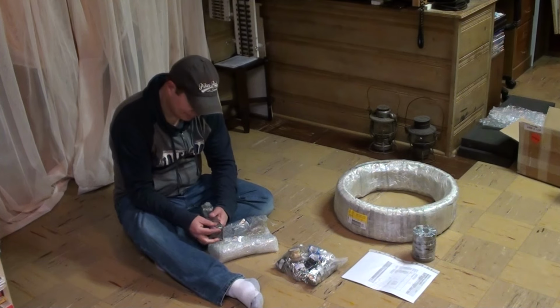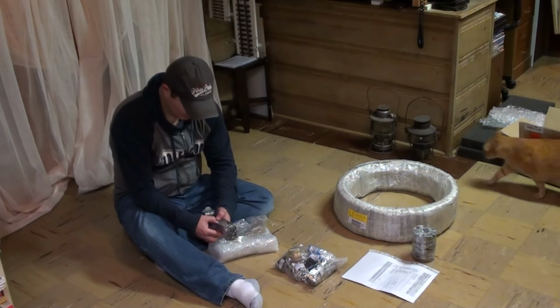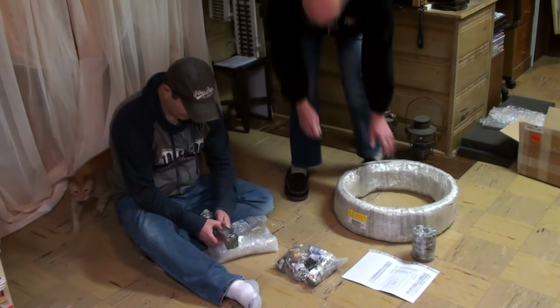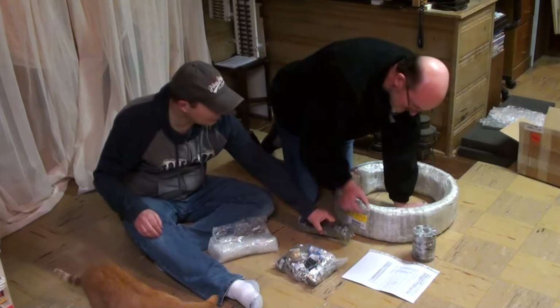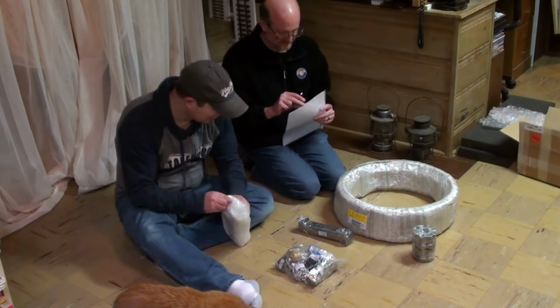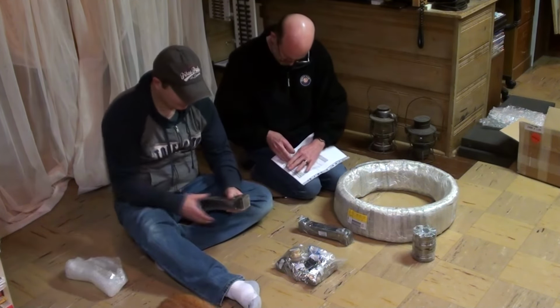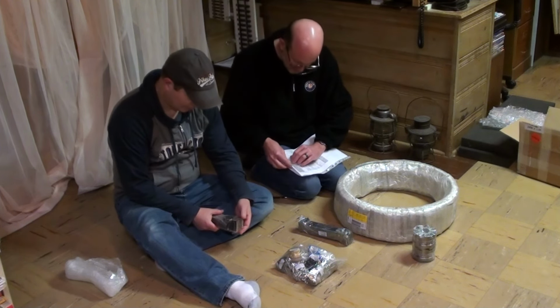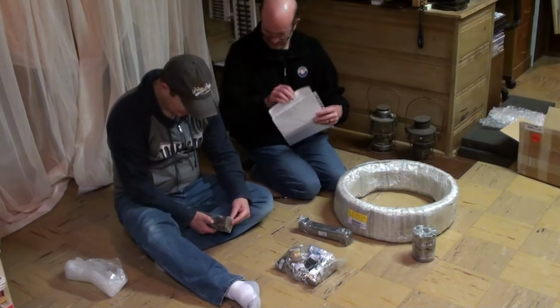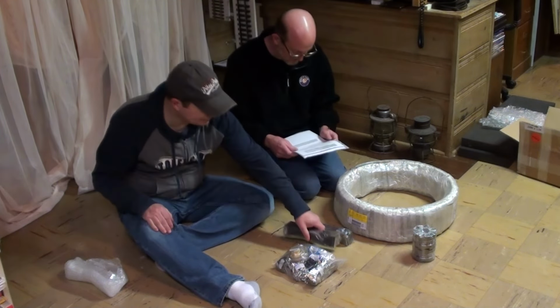The engine features a crankshaft-driven water pump and steam injector, Stephenson's valve gear, rubber tires, an operational governor, and working rear differential, and has a 3-speed transmission and an axle-mounted drum winch. A steam siphon, blower, and whistle are also included. It is capable of carrying 2 adults and can pull about 5 tons.